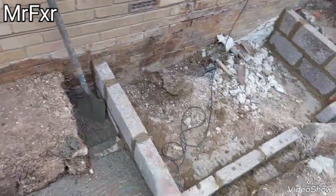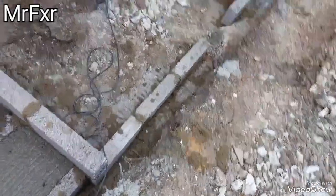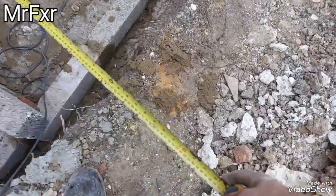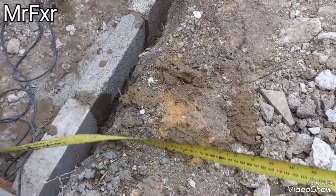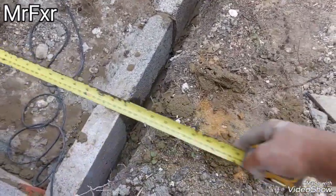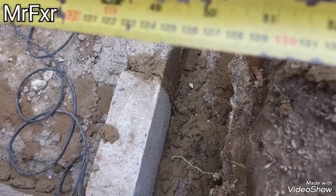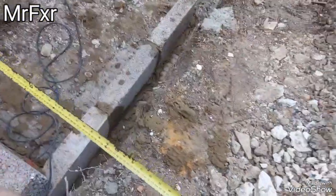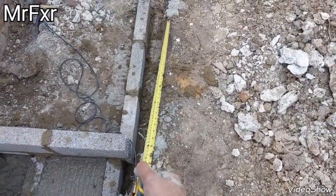And here I'm going to have a slab. It's actually not coming that far over. It's not coming miles over the pipe, it only goes a couple of inches over the pipe. Needs to be something like 1350. You can see there, 1350. It's literally just 1.5 or 2 inches over the pipe. So all I need to do is bring it to about here, slab.